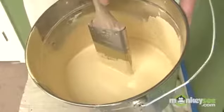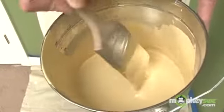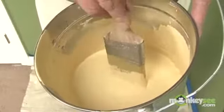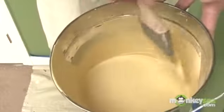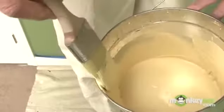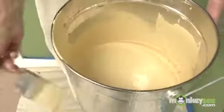So now we're set up to brush — let's cut in our wall. Let me explain about loading a brush. Dip it into the paint; we've got about an inch at the bottom here. Not more than half the bristles is all. Then just tap it lightly on the side of the paint can to get off the excess paint, or wipe it lightly on the inside of the rim so the paint doesn't run off the side.